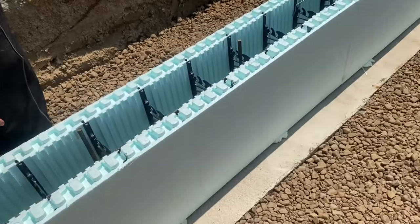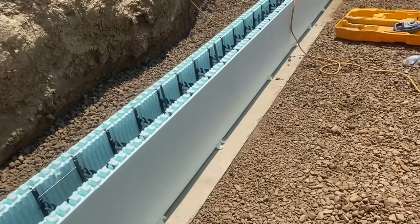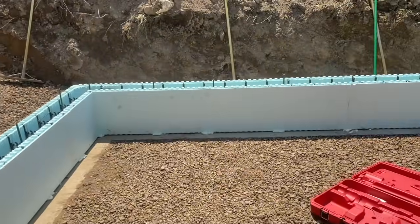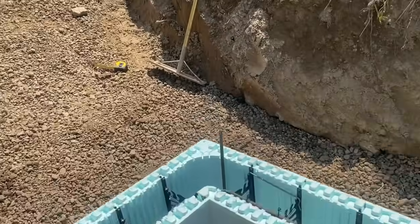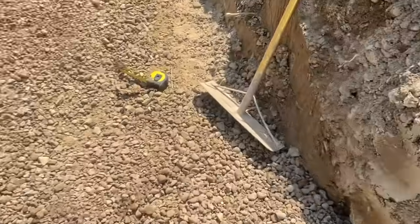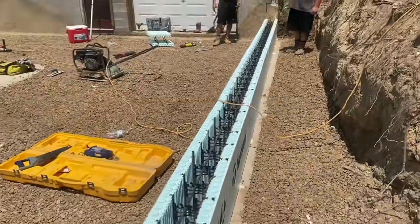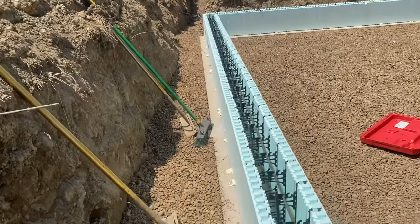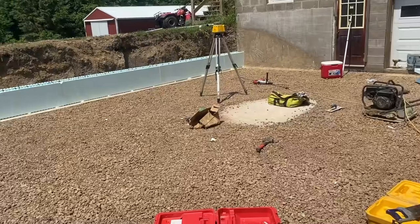That's what we do, guys. Just a little zap, bing, bing, bing, about every 2-3 feet right around there with spray foam. Like I said, we had a snap line on the footer, so you've got to make sure you stay on that footer. In about a half hour, you won't move this. You can see how Big Biscuit got the outside all the way down through, and that holds this very well, guys, for getting this first course in.